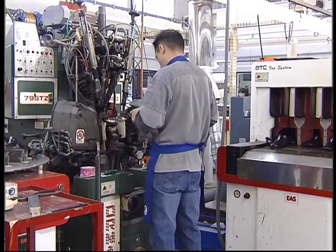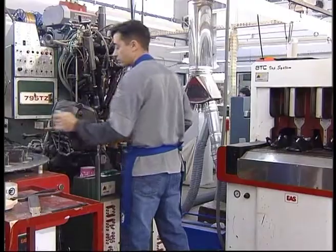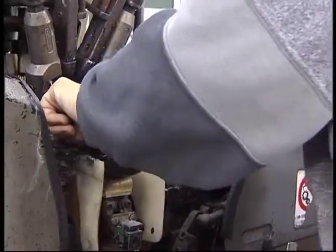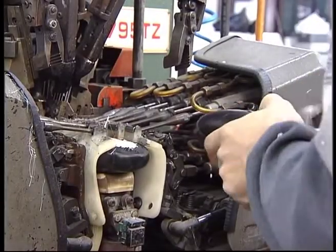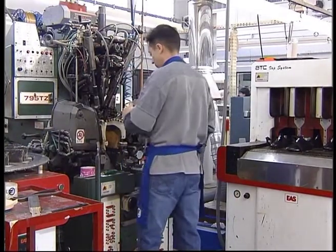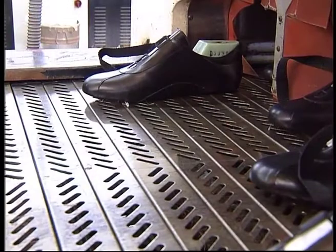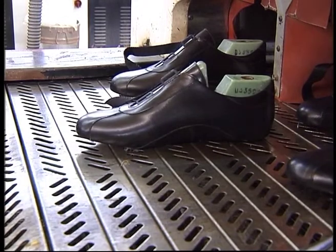To close shoe sides and seats. Before executing this operation, it is necessary to proceed to the reactivation of the stiffener so that it is possible to mold and seal correctly the area of the shoe sides and seat. For the correct execution, it is necessary that the height of the counterparts on the last is verified and, if necessary, readjusted. To stabilize the upper on the last: this operation consists of the placement of the upper mounted on the last in the tunnel designated as the stabilizing tunnel. The temperature of the stabilizer must be in agreement with the type of skin, as at high temperature the skin has a tendency to contract on the last, being adjusted to it.